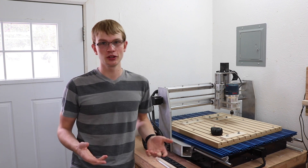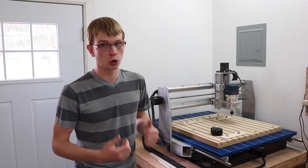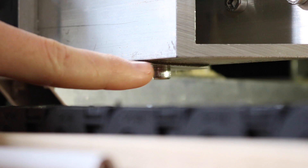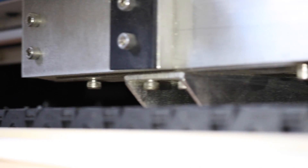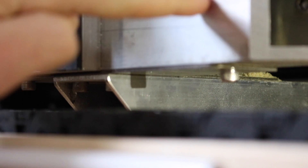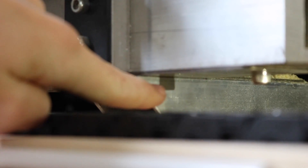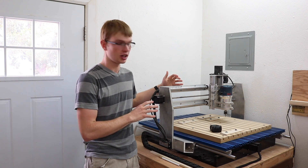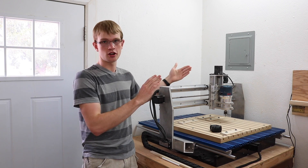There's a very important part that's difficult to see and I don't have a pre-assembly picture of it. The plate I'm trying to show you — that little thin plate — is like the top of a T, and back in there you can see the other end of the plate, which is like the bottom of a T, and that's where it's bolted on. That T-shaped piece of stainless is keeping this piece up here square to the piece that runs under the table. It is the only thing keeping the x-axis square to the y-axis.